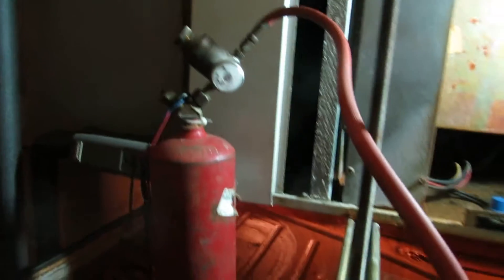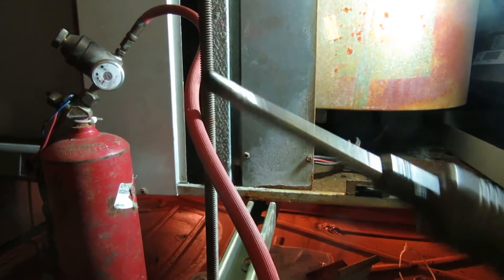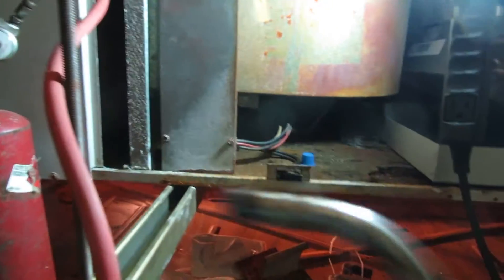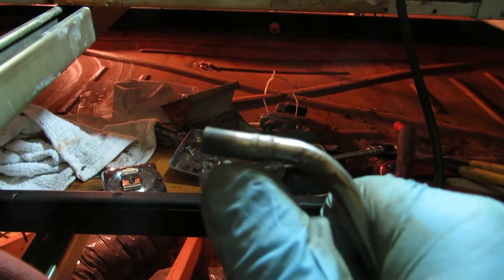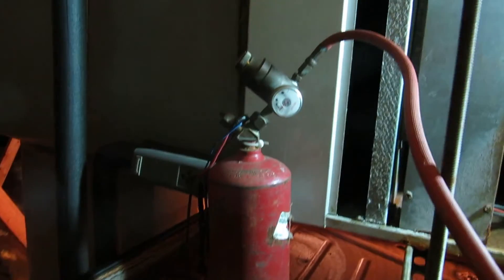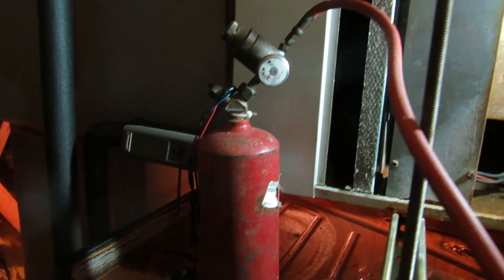Check out this little MC tank with a little turbo torch tip. I don't use different sized tips much, but this is great for coming up in attics. Little MC tank, turbo setup — acetylene turbo. You can tell this is an MC acetylene propane — it's got two stripes. The regular LP propane, which a lot of plumbers use, has one stripe. That's the difference. This is a small tip. I got a bigger one, but this thing will probably be fine. I found this at a swap meet — the guy paid 15 bucks for it. It's in good shape.